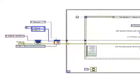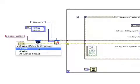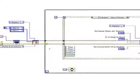Looking at the block diagram from left to right, we can see that in the normal fashion we're opening our connection to the Arduino. Then next we're opening a connection to our stepper motor — stepper motor number one — configuring it to be a two-wire pulse and direction configuration, which is what the EasyDriver motor controllers use. It also supports two-wire and four-wire H-bridge configurations, as well as using the Adafruit motor shield. Our wires are connected on pins 12 and 11, as specified here.